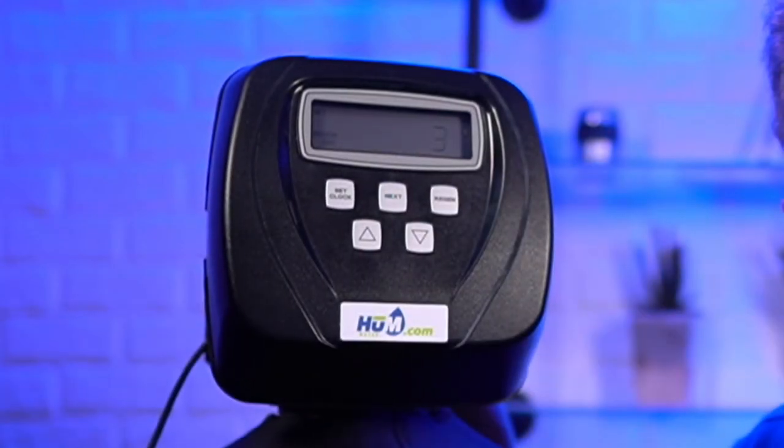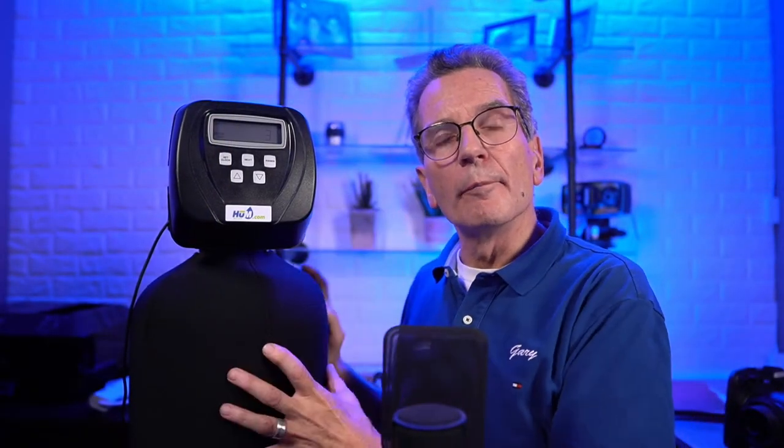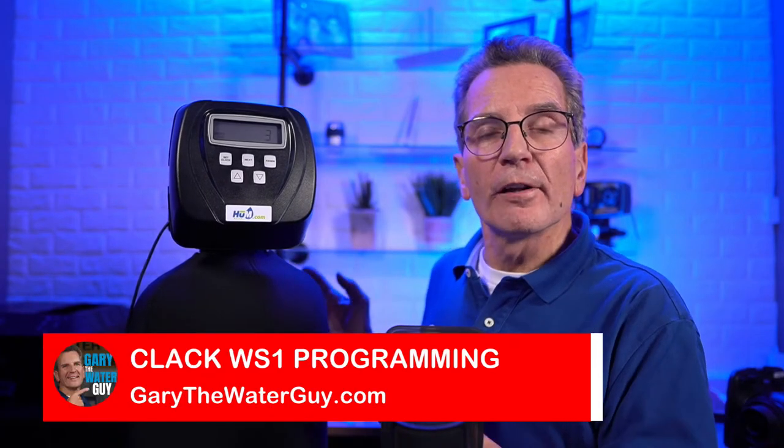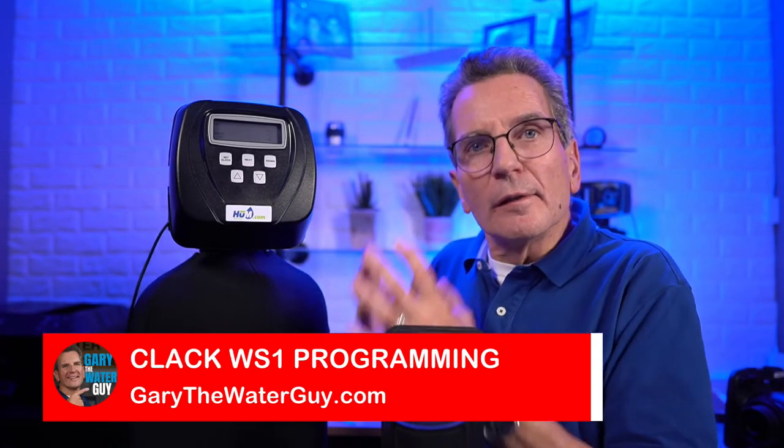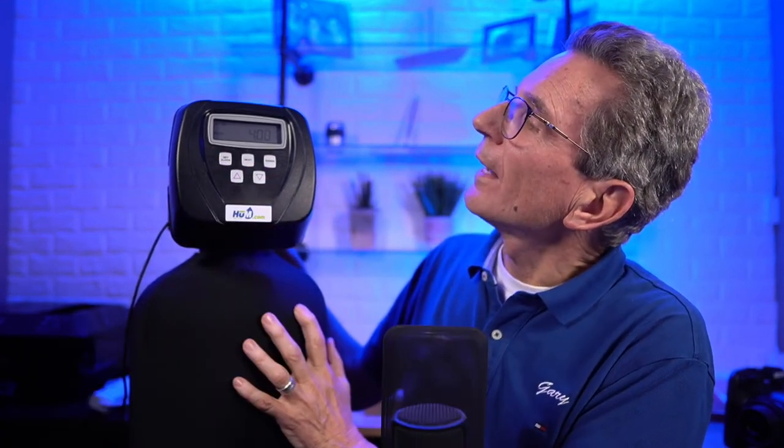So every 3 days. Again, iron is a similar situation to the tannin filter in the sense that you want to regenerate it every 3 days to fluff up that media and to keep it loose. Okay, and so that's why you need to set that for every 3 days. And the time, again, I would normally set this at 1 a.m. if I had several pieces of equipment here so it doesn't conflict with the others. And then press next, we can set the minutes. And then we're back to the time. So those are the basic settings for that.